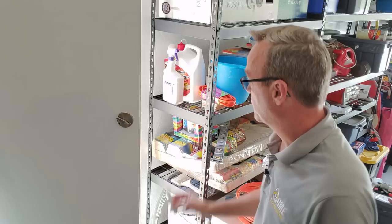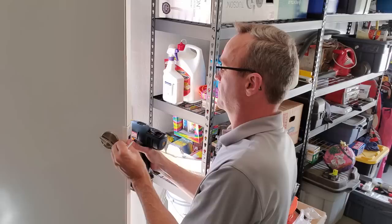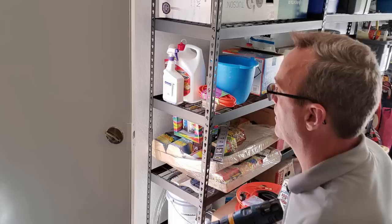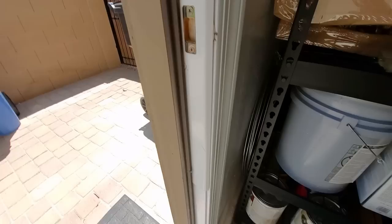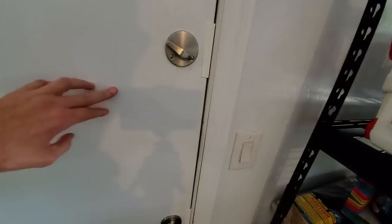These door wraps are really easy to install as well. You basically just put them above your existing plate, then drill two holes right in and they go right on. Here is the strike plate installed with the cutout, and also down here with the cutout from the bottom latch — my locks were installed quite a ways apart. Both of these are now installed onto the door, and I verify proper operation: door closes, everything locks. We are good to go.